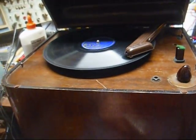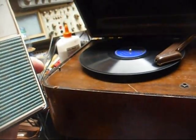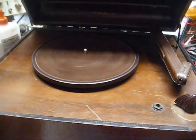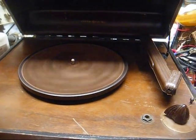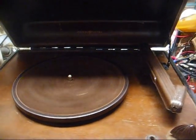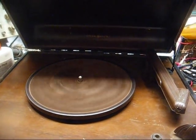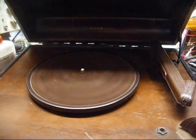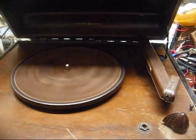The donor cartridge is attached — it's kind of sloppy looking but it's in there, and given that I didn't have the original cartridge, it's the best I could do. Raking my finger across the needle shows plenty of output on the AC voltmeter. Let's install the tone arm back on the machine and give it a try. I can tell the oil has seeped its way around into the motor gearbox after sitting overnight — it's quieter today. All I'm hearing now is the vibrations of the motor making their way to the cabinet, which is normal. I think this thing is about done.